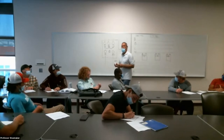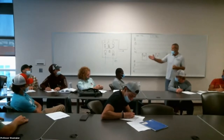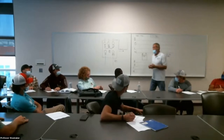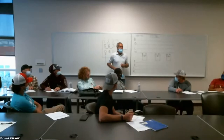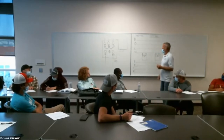Do not do that in the rain. Water and oil don't mix. So if they want you to make a change over on a transformer to a single voltage, get it under a shed if it's raining or something like that. I've probably found this situation multiple times. What are you doing in the summertime when you work? Sweat. Don't drip sweat in there. As soon as you get water in there, it messes up the dielectric of the transformers.